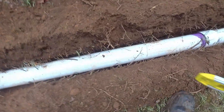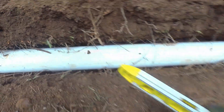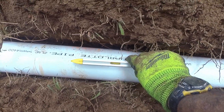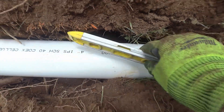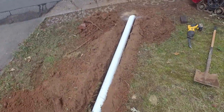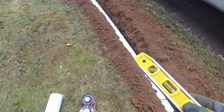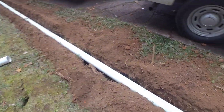A quarter bubble is what you need but we'll take as much as we can get. Quarter bubble there, quarter bubble there - now we're back to a full bubble so the ground is kind of going down too. That's how you tell the pipe is installed correctly. The level doesn't lie, and if that pipe is sloping downhill that water is going to gush through there.